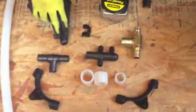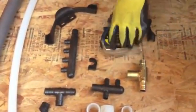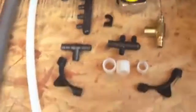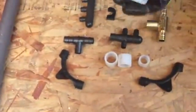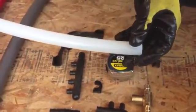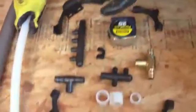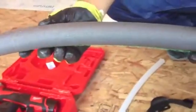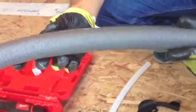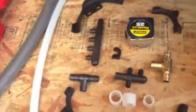We also have different types of fittings used to branch off or extend the pipe — T's, manifolds, and different types of specialty fittings. Of course, we're going to want to measure things, so you will have a measuring tape. All of this will be used on different sized pipes. Clear indicates cold water, whereas red pipe indicates hot water. This is a three-quarter inch pipe, and this is the type of insulation used on both half-inch and three-quarter hot water only, so that there are less losses from the hot water line.